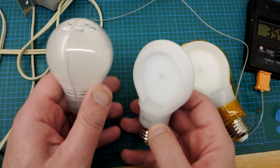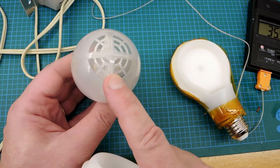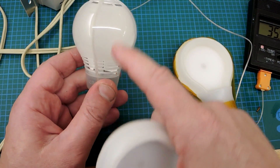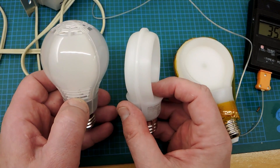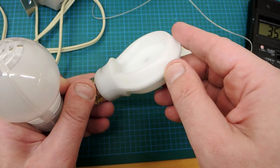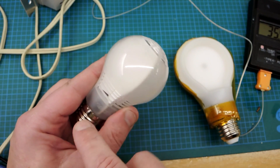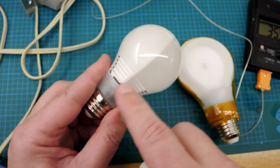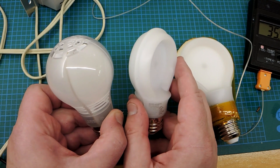When I look at Philips' main competitor, they've also tried this assembly where they put a circuit board acting like a heatsink — heavily plated — but they've made one major difference: they put fins into their bulbs so they can create airflow through it. This Cree bulb has quite a larger warranty period. I wonder if enclosing the heatsink with plastics like this is leading to the really high thermal rise. The Cree bulb is not perfect either — they didn't conformally coat the electronics, so bugs, debris, and dust collecting onto the circuit board could eventually short things out and cause a failure. So it's a really interesting little side branch of LED bulb design.